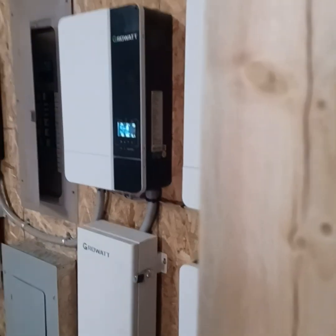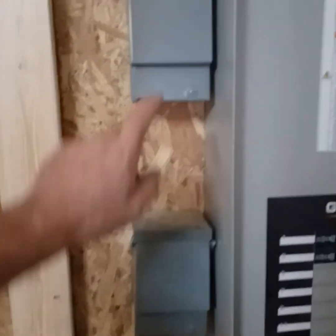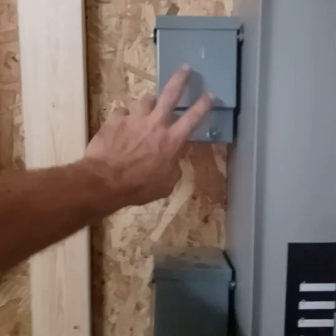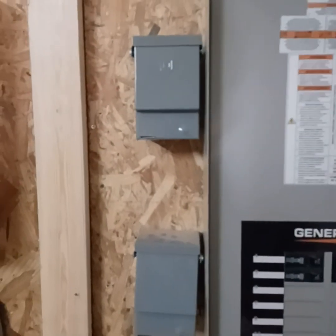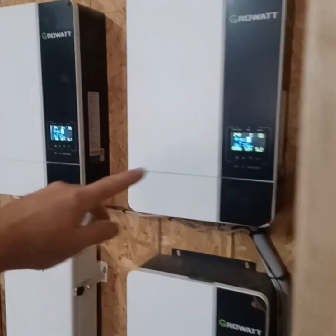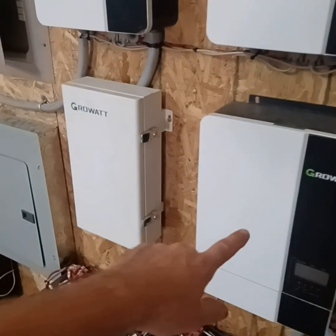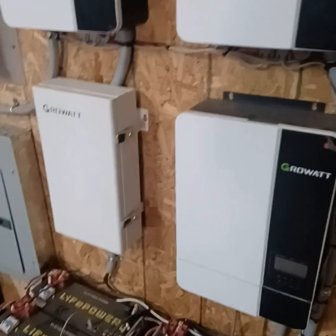We are running for the inverter, so that's about 80% of this load right here. We have PV-1 and PV-2 coming in. PV-1 operates inverters 1 and 2, and then PV-2 operates inverters 3 and 4. We do not have enough solar supply for the bottom inverters — those are just made for power output only.